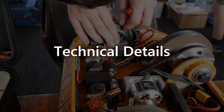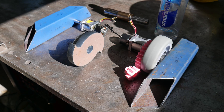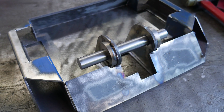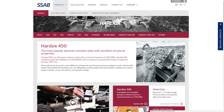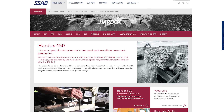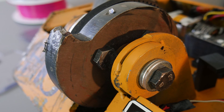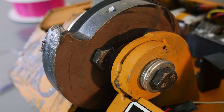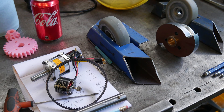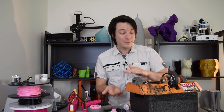Do you like technical details? Here you go. For the frame, I went with a combination of mild steel rectangle hollow sections and 6mm thick Hardox 450. Hardox is a class of steel known as wear plate, used extensively in the mining industry for everything from dump trucks to the teeth on diggers. It's awesome for robots because it's made with an extra hard surface but a softer inner portion, which prevents it from shattering like a through-hardened tool steel might. It's also very heavy, which is why the robot frame needs to be so tiny and compact to fit within the weight limit. The frame itself is only 50mm high, which is why I can get so much armor onto this little thing.